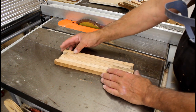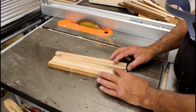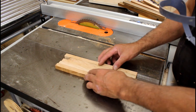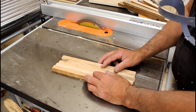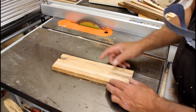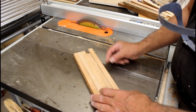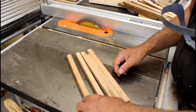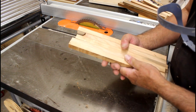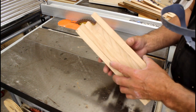I've calculated that with the spacers I need about at least 15 to 16 inches of cherry, and I have enough here. Now if I had a longer piece of cherry — I'm just trying to use up the firewood pieces — I would cut a long piece five-eighths by five-eighths. Then I would likely just take my laminate trimmer and round over the corners. Laminate trimmer on small pieces is a little too close to the hands for my liking, so I will just kind of gently soften all the corners on my belt sander.